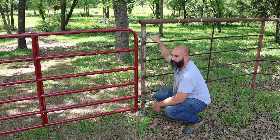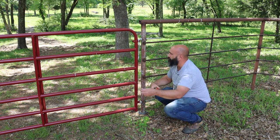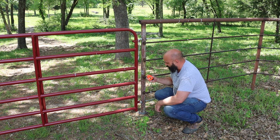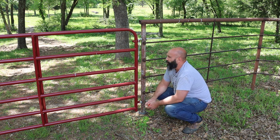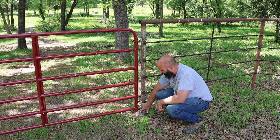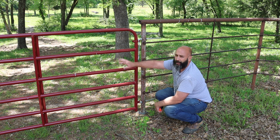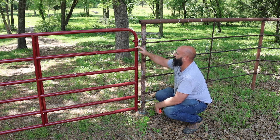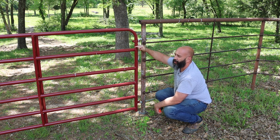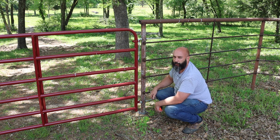Now there's probably a few different ways you can measure where you want it to go. Of course you could take one like this if you have a match. You can just measure from this latch or this hinge to this hinge and get your measurement for your next one. Alternatively, you can put it on, you can drill where you want it to go on the bottom, probably offset about that far from the bottom, drill that one in, put it on, pick up the gate, probably have some help, set it up here, get your hinge, decide where you want to drill the bolt based on the hinge. You can move this hinge up and down, but basically you have this spot within a few inches that you could probably set your hinge and go through the bolt. It's pretty flexible, but you do have to kind of plan ahead.